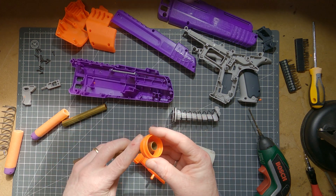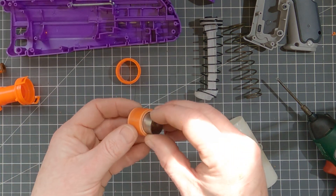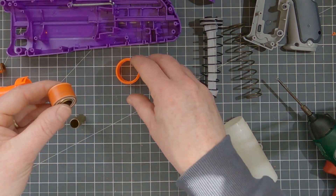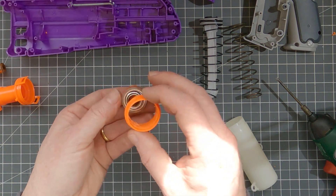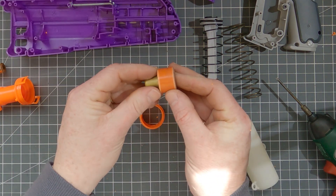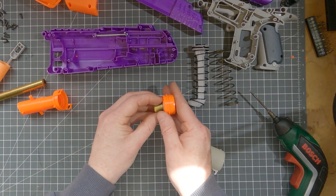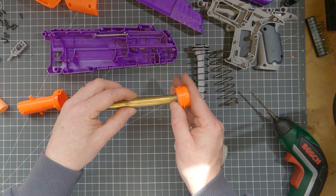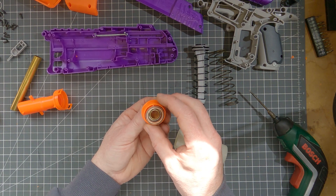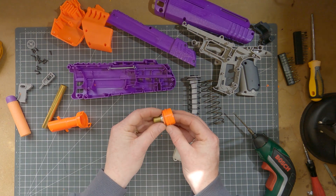I'll see if I've got some PVC pipe that'll do the job. Okay, so I've just got some random bits of pipe of different diameters, some plastic, some metal. And I'll just glue these in place like so with some epoxy. That'll need some tape to centre it. And then this is my half inch brass. And I'll glue that one in last of all — so that's how this will protrude from the front of the plunger tube, ready to receive the 17/32nds brass when I stick the barrel in. So that's what I'll go ahead and glue there. It's relatively close; some might need a little bit of tape. But otherwise I'll just epoxy those all together and that'll keep it nice and centred.